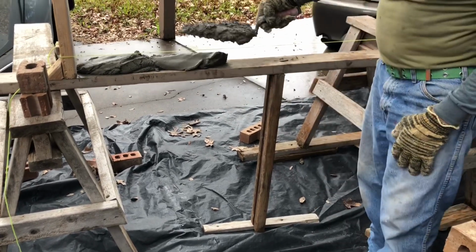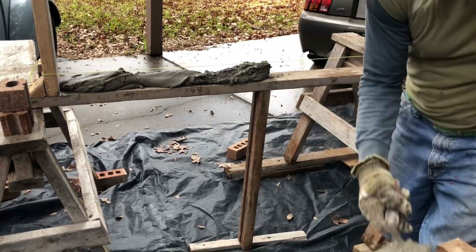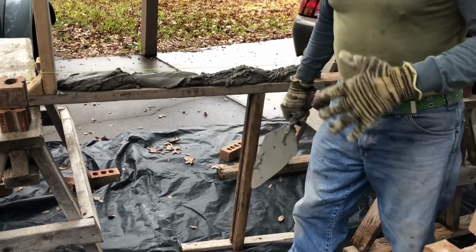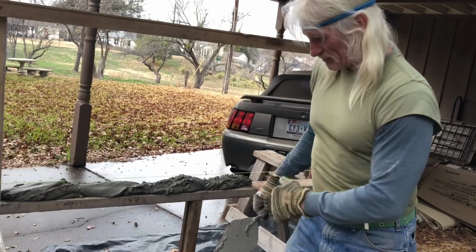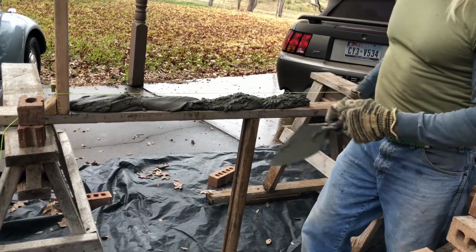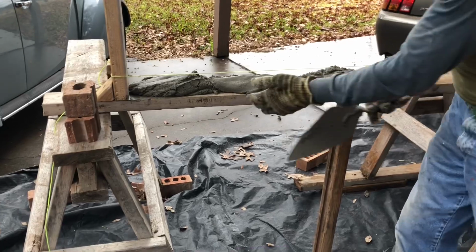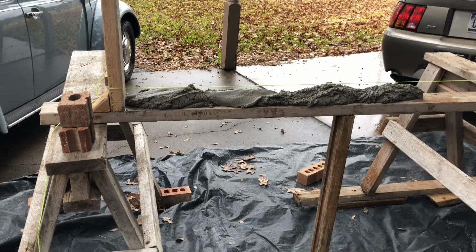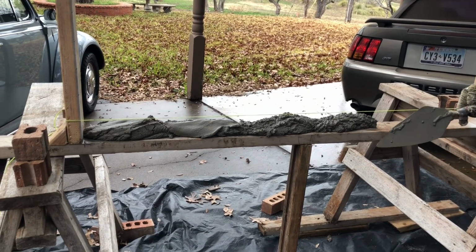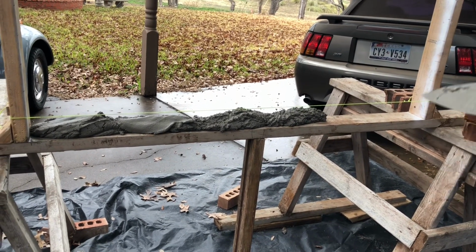Again, over the footing, put it down. Just like that. Over the footing and put it down. Now, we're going to start by laying one at a time. That way I can show you everything to look for when you're laying the brick. Okay, you see my upright. It's flush with this, we'll call this the footing, concrete footing, on both ends. So the bottom of the brick should be flush with this right here, just like this is. We're following this to keep it straight. So we got to follow that to keep it straight.